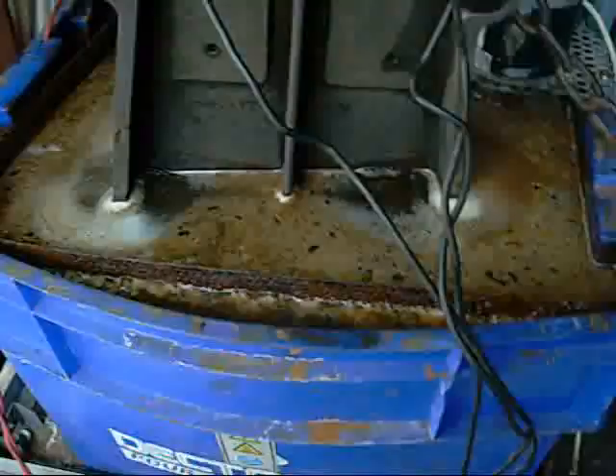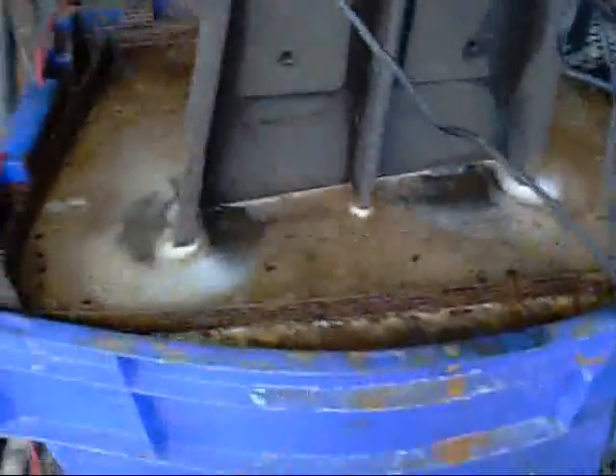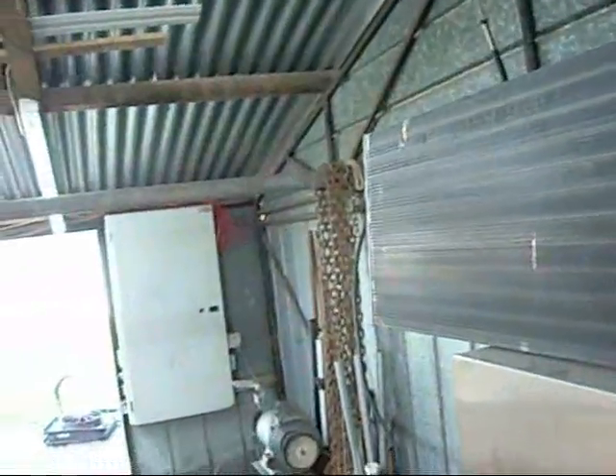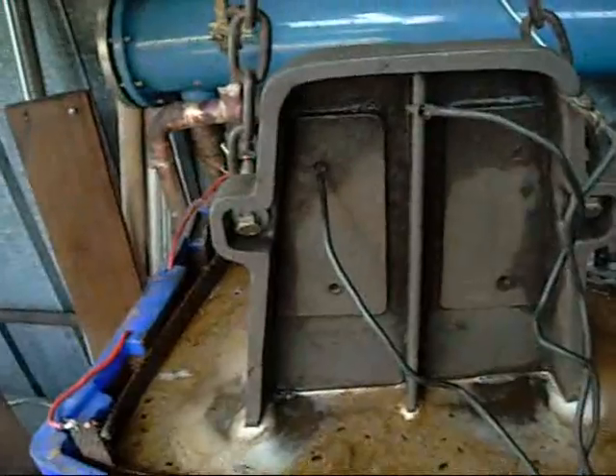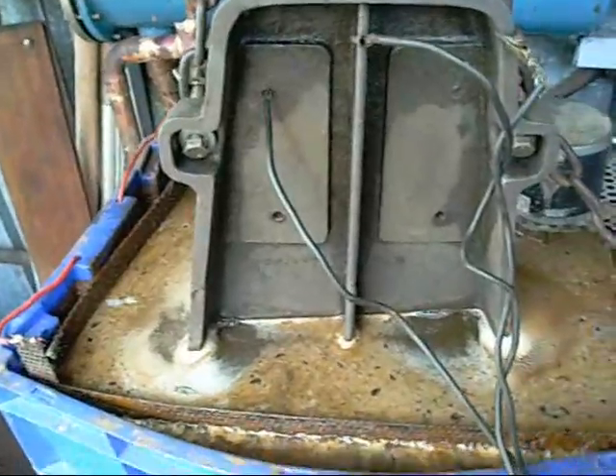The tank's not big enough to take the whole piece. There's the second part of it being done — I've made up a crude little sling for it. The only problem with moving the tank across is it's not directly under this beam anymore so I can't hang off it. Eventually I'll put another crossbar all the way across with a roller carriage on it so I can run a crane and block-and-tackle. I'll probably have to relocate the compressors and run beams straight down to the ground and bolt them down to support the weight, but it should make a nice little monorail crane. I've already found the piece of I-beam I want — I've just got to find some uprights and put it into action.